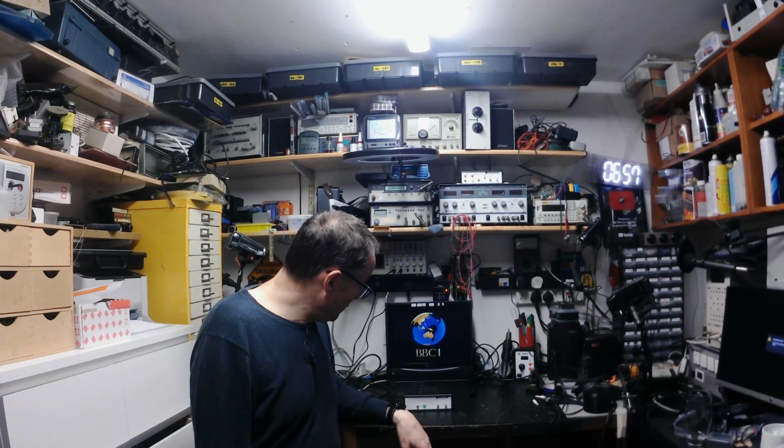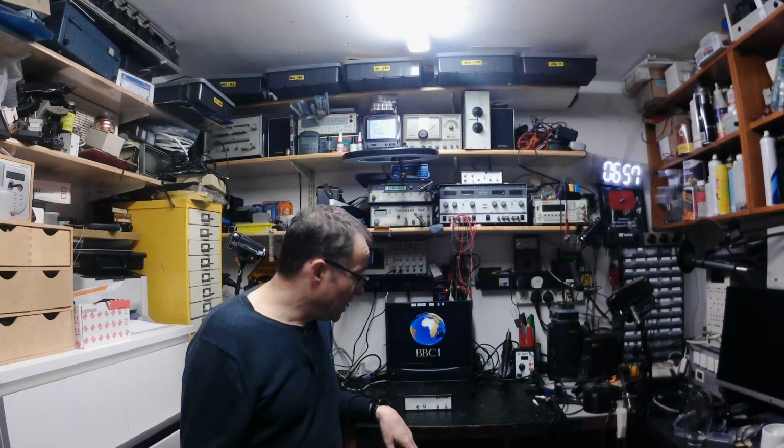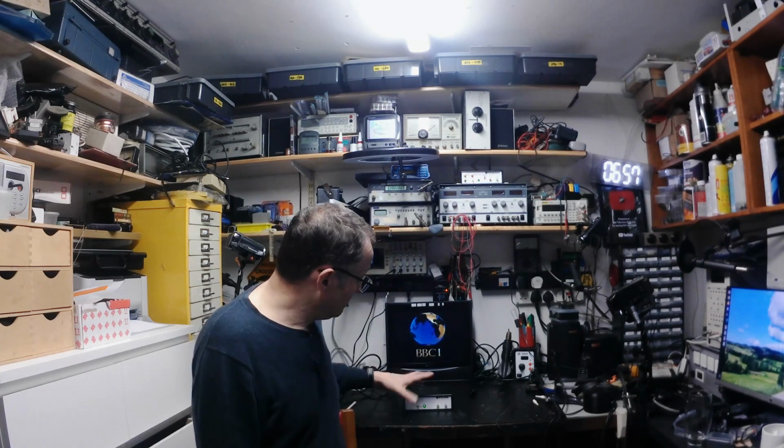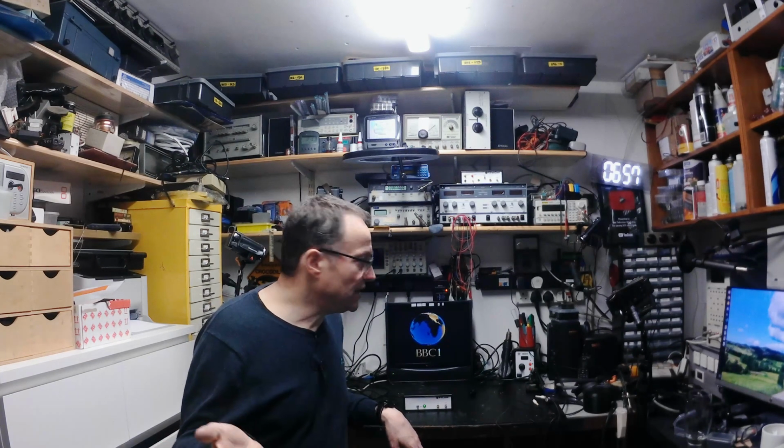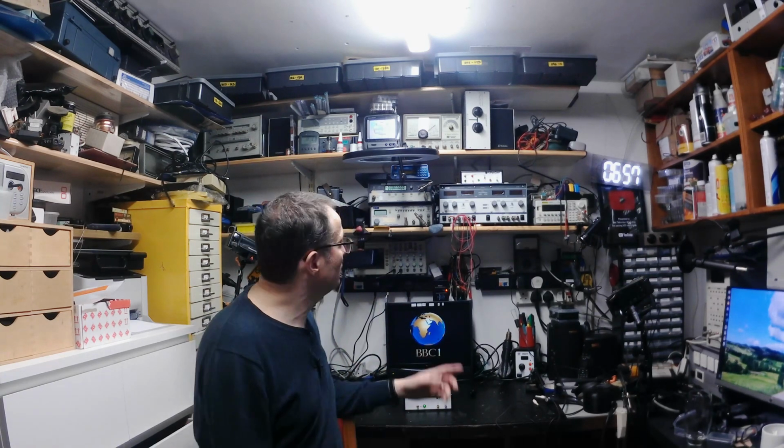Yeah, so there we go. Download the image from MediaFire, link is in the description. Write it with your favourite Raspberry Pi imager or other software, stick it in your Pi and let me know how you get on. Don't forget, if you've got a more modern Pi, you'll need to find where the TV out is, and it doesn't work on a Pi 400, which has no analog video out. The image is PAL only. If there's enough demand, I may make an NTSC one.